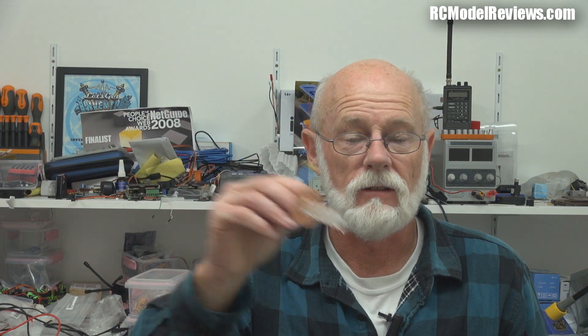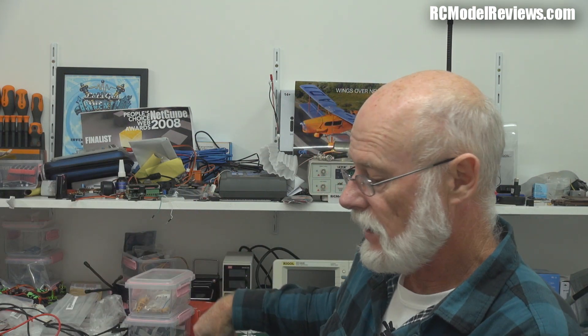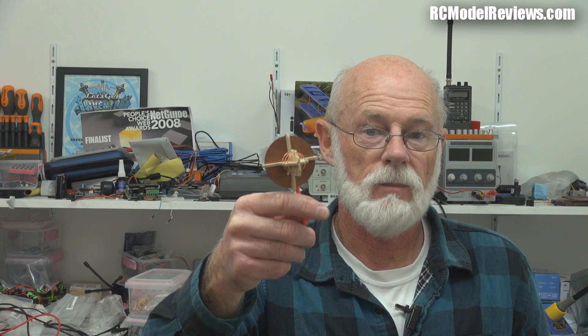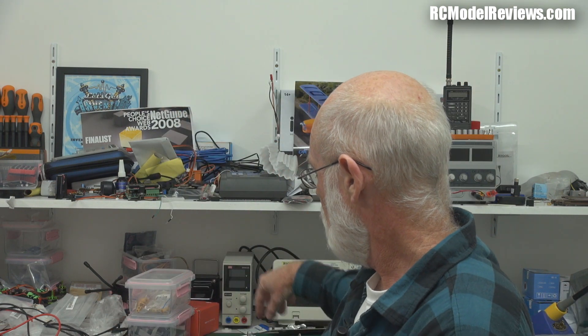That wide beam from the Circular Wireless is a testimony to the quality of its design and manufacture. The UK one — for the money — is really good value. It massively improves your range and has an adequately wide beam. With diversity you won't need to worry as you can combine it with a cloverleaf for close-up all-round coverage. The three-turn one has a wider beam than the five-turn and it works — it'll give you much better range than a standard cloverleaf. It's also cheaper and more compact, which matters if you're mounting it on video glasses.